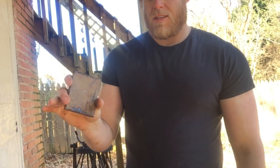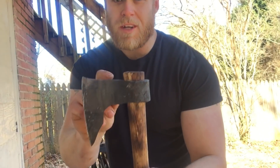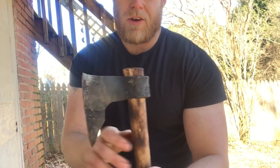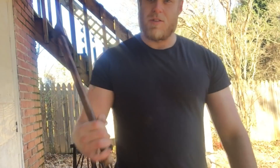I got a piece of leaf spring that I'm going to make the entirety of the blade out of, and a piece of that same flat bar that I'm going to make the eye out of. I want kind of a longer neck area. The eye on the last one was way too thick, so I'm going to thin that down. And I want kind of a longer beard on it. So that's what we're trying to do — stick around.